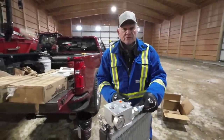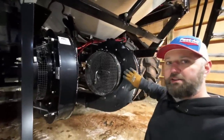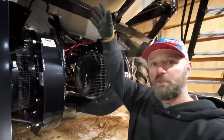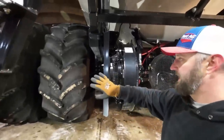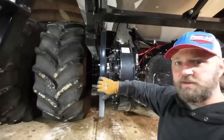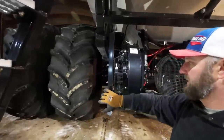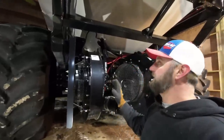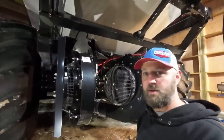Okay, where we'll be tying into the case drain. The first step is we gotta get rid of all the stuff that's in the way, because we gotta mount that radiator flat to this fan, and then from there we'll go up with a snorkel. So pull this screen off — they put the shield on here to protect the fan from sucking in dust and chaff that comes off those tires. That's a big part of putting these snorkels on — we'll suck clean air from up top, none of this swirling from down by the tires, especially in our usually dustier climate in seeding season.